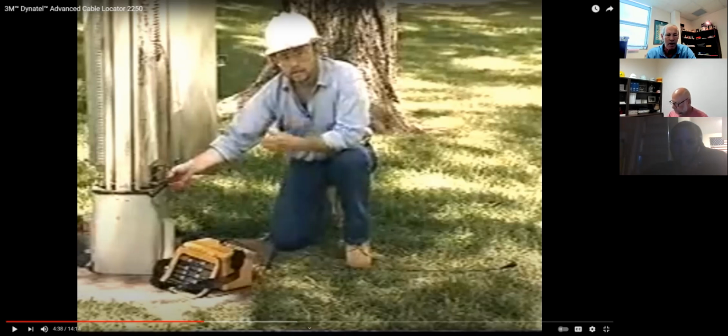Do you think it went straight out from the pole down the ditch and took a right or a left into the switch gear? Shortest distance possible. Yeah, the shortest distance from point A to point B. And that's your suspected cable path. Remember that through your entire careers. If you see a transformer and you're looking for the next pedestal and want to try to find out what the path is, well, find it with your eyes, and it's going to be a straight line. That's one part of this, suspected cable path. You don't have to be exact.